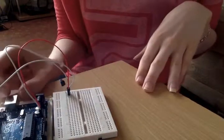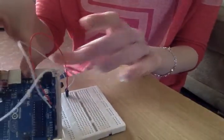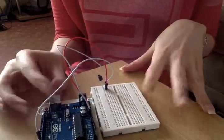I then pasted that code into the send code, which is also linked in this video, and that allows the Arduino to send that information to the TV using the infrared LED. So I've been able to change the channel using my Arduino.